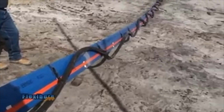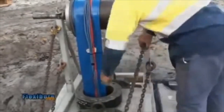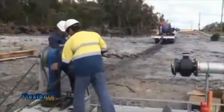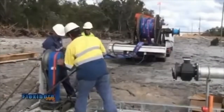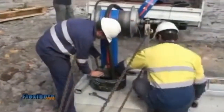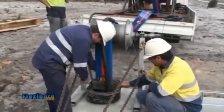The cables have been correctly snaked in order to compensate for the low extension that the hose may be subjected to. With the vehicle taking up the tension, the first clamp is released. The truck reverses and the pump is now lowered into the bore under its own weight. The crew monitors the straps and is careful to let the hose go over the roller smoothly. The process is repeated and the first clamp is reattached, now holding the pump 50 meters deep inside the bore.